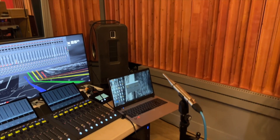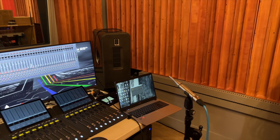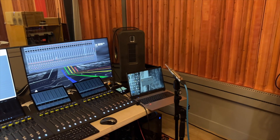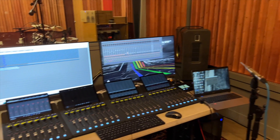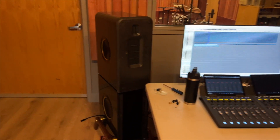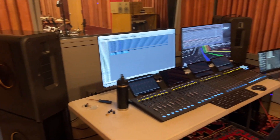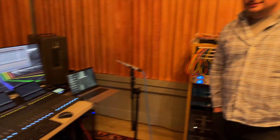And there's your measurement microphone. We have a nice little Earthworks mic. These are near-field custom near-field monitors that Chris has built based on the FR-30. And there was a 33 hertz and a 75 hertz mode bump, yeah. And so we're just knocking those out.